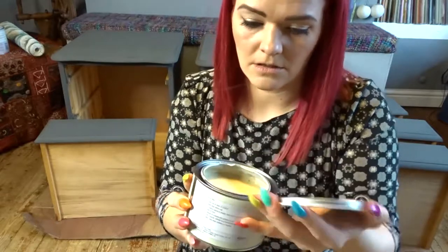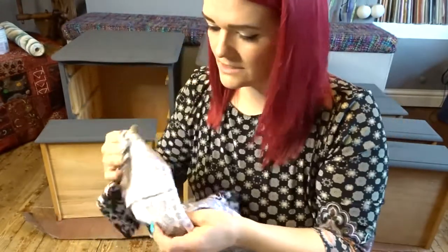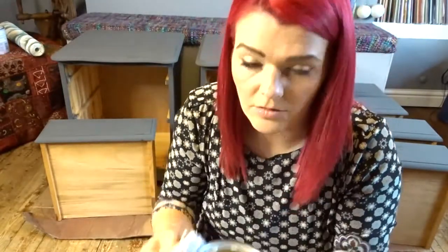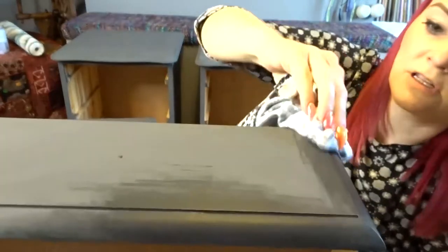While I wait for my handles to dry and decide whether to paint them silver or go with the grey look, I'm going to use some finishing wax, applying it with an old rag or a paintbrush. The instructions say: apply sparingly in small areas at a time with a brush or soft cloth, allow 10 minutes to dry, then buff with soft cloth to desired sheen level — and apparently it can take up to three weeks to cure. I thought about distressing this, but after a few months in my house it'll be distressed anyway. We just rub this all in to protect it.